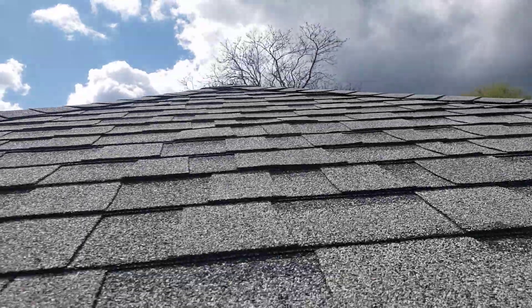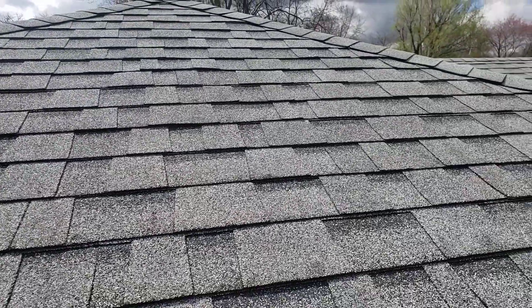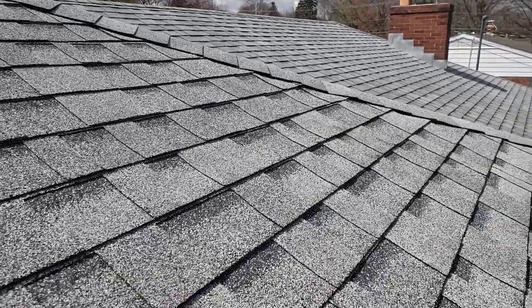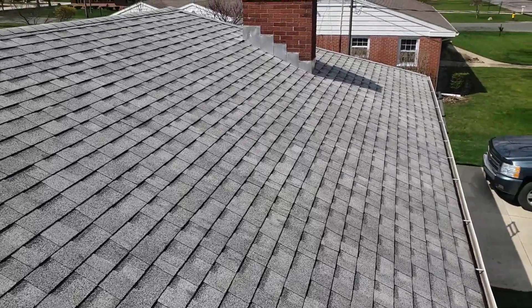All right, look up here — see how raised those shingles are? They're not laying flat. These are all those nails working their way up and essentially pushing the shingle up. Joe with Jay Alexander Roofing — I'm just going to start pulling some measurements now, and then I will be ready to prepare an estimate for you guys. Thank you.